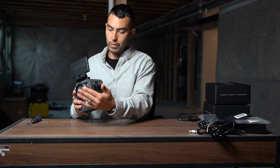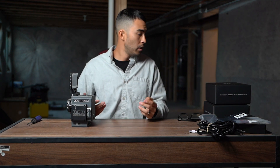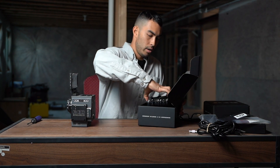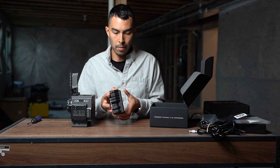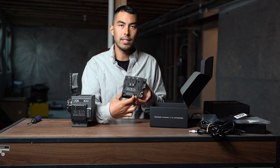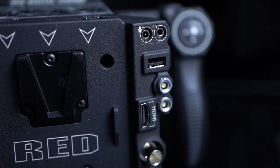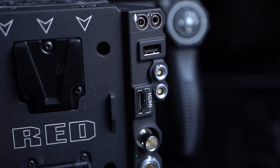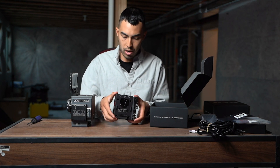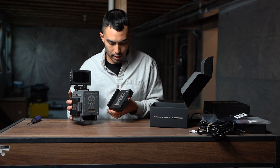Next up, we've got a way to film, we've got a lens, a way to control it, something to record to. Now we need to figure out a way to power this brain, because it doesn't have a normal battery. So we had to pick up the DSMC2 V-Lock IO Expander — that is this guy right here. You can get just a V-Mount, so it doesn't have this side portion with the SDI, HDMI, and sound and stuff like that. If you get just a V-Mount it's about $750, but to get this entire thing with all the I/O — which is running $1,900 — you get SDI, HDMI, sound inputs, USB, timecode sync, and stuff like that. It's on the back here with some pins that, once again, line up with ports on the camera, so it completely eliminates the need for cables.